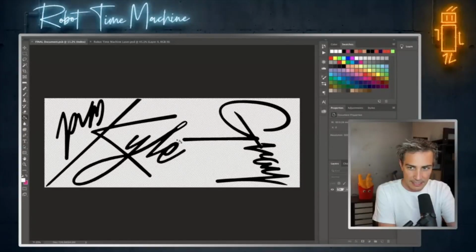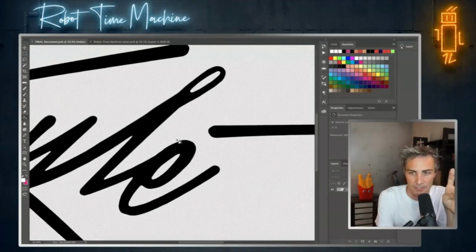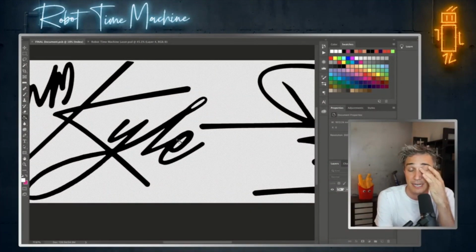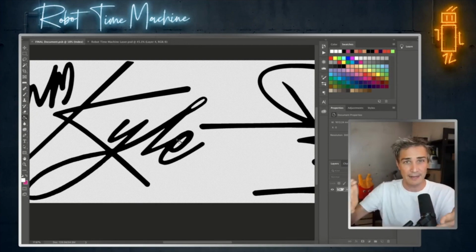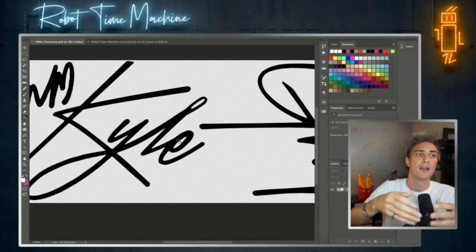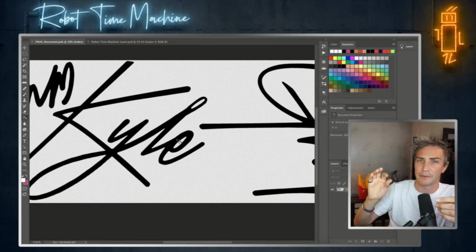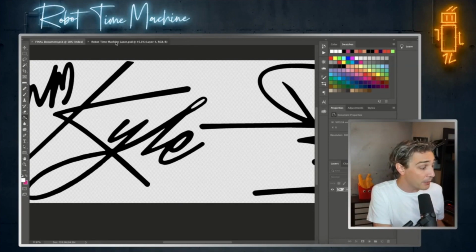One of the things you will have noticed is that you don't actually use these bold shapes. I'm just showing you here so that you can see what the file looks like. That's not the file that you actually send to the printer. You create outlines, and then depending on the settings of the printer, if the line is colored red, that means use 100% intensity, or if the line's green, there are different ways to set it. You can set it by thickness. So if you just want to engrave, you can set it to engrave and so on. Each one's different.